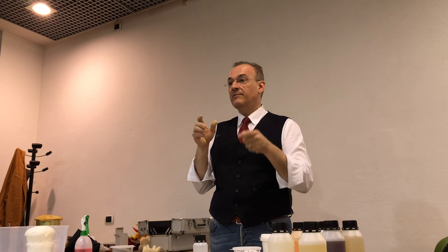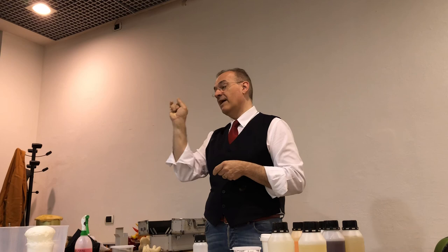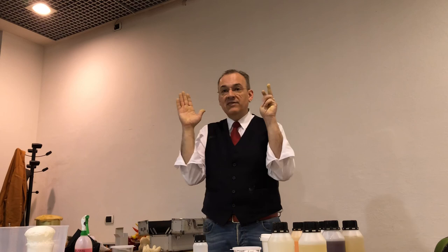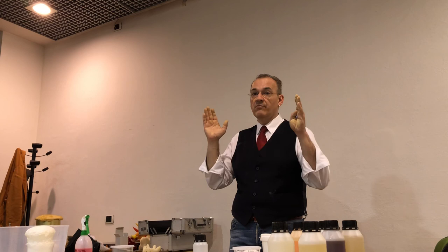It means that when you make your project, if you have to have a special measure, remember that it's better for you to make a test on the material, because if you need 11 millimeters, maybe you have 10 millimeters and 8 tenths after some days, okay? Usually in the technical sheets, it is written how much the shrinkage is. But remember that it is a shrinkage calculated in a lab with 21 degrees, with 70% of humidity, etc. You will never work in the same situation. So it can be less, can be more. The best way is to try, okay?